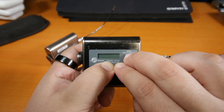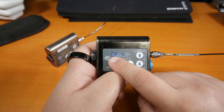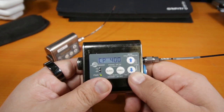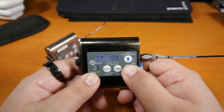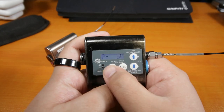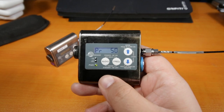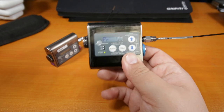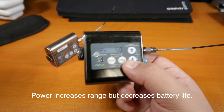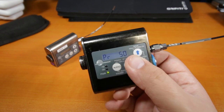It's a little tricky, so you'll need to practice. Once you hit it, it no longer says audio level — it says 'CP,' which is compatibility mode. That means this transmitter is compatible with older and newer Lectrosonics receivers. Right now it's set to 400, but you can go to compatibility mode 3, 200, 100, 6, IFB, or 400. I keep it at 400. Press any button to advance to the next menu — power. Currently at 50 mW, but you can go all the way up to 250. For perspective, most Sennheiser G3s and G4s transmit at 30 mW, not even 50.